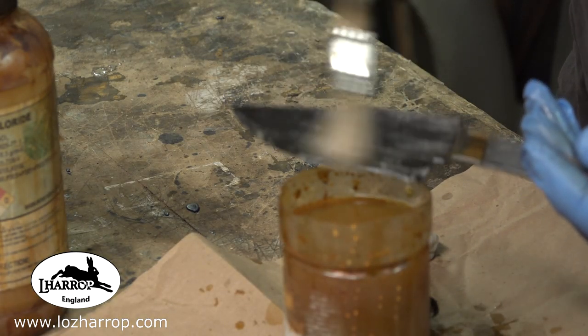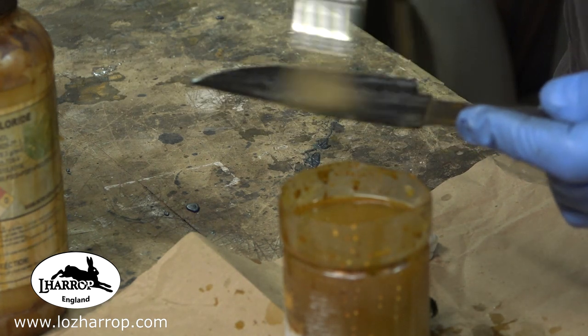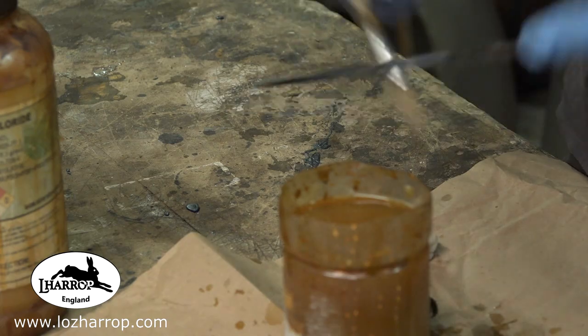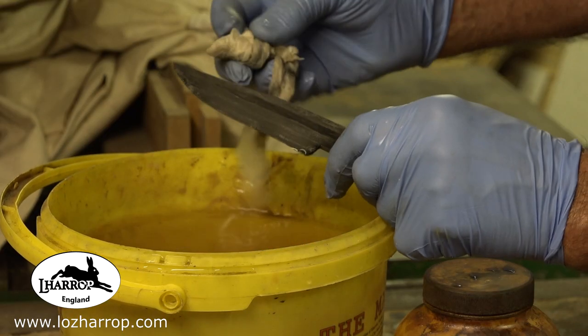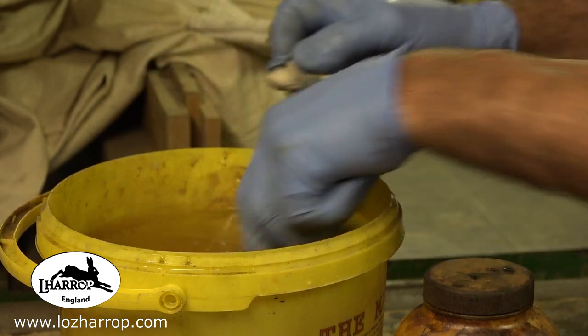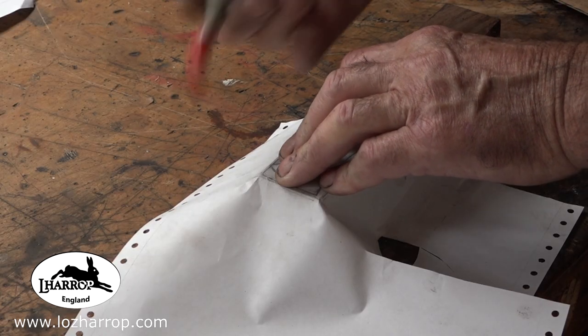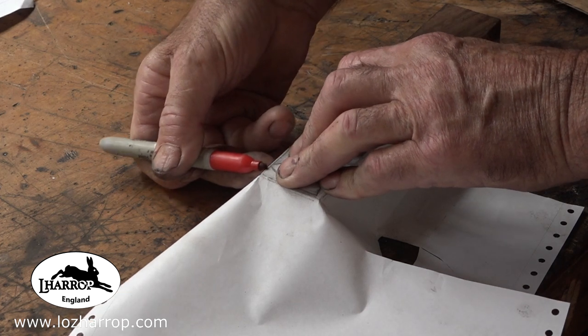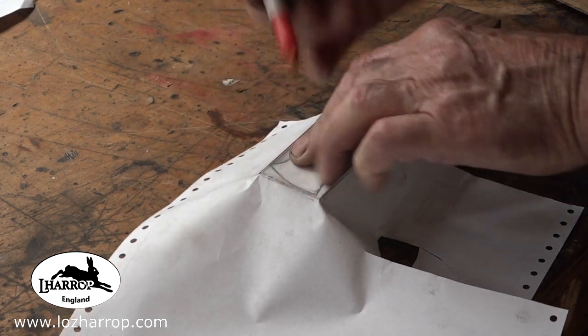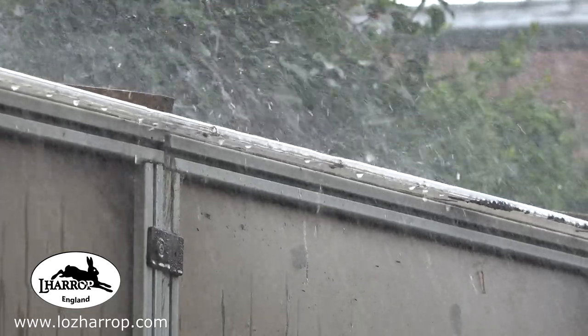I think this was the last etch, so I filmed the last one. I generally figured that it was deep enough now. It feels like a fingerprint, you know, real ridges along the steel. And the last cycle I did was in coffee, and I left it in coffee just at room temperature overnight. So it was in coffee probably about 10 hours.